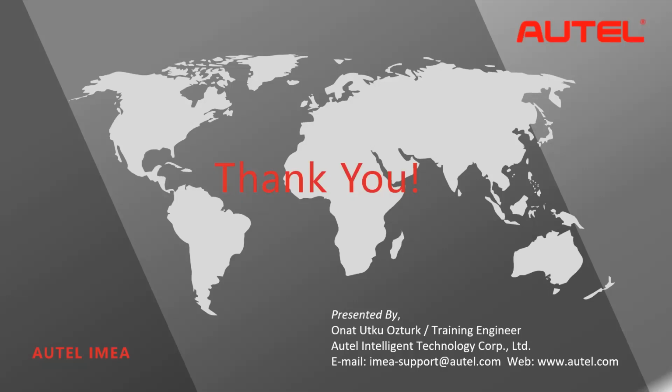There is a question from Ahmed. What is the EV diagnostic tool model? It's the AUTEL MS909 EV. There are not many EV diagnostic tools in the market right now. If you know about them, like our AUTEL tools, we already have third generation diagnostic tools, called 909, 919, and Ultra. If you have these diagnostic tools, you can upgrade them to EV. You get an EV diag box for offline battery diagnostics and other things, and also the software for electric vehicles. So you're turning your third generation diagnostic tool into an EV tool.